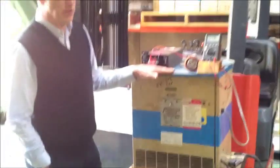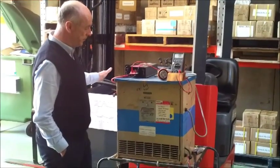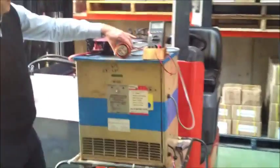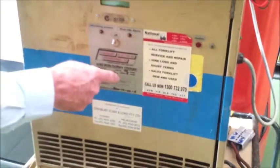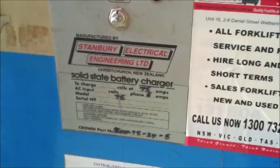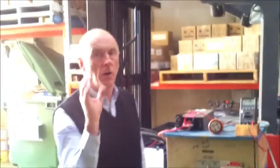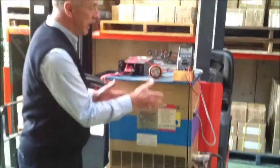This battery is normally charged with a charger of this size, and because of the power requirements of this battery, you normally have to have a three phase supply. This is the three phase plug from this charger. It normally charges at around about 75 amps and it takes quite a lot of power. A lot of people don't have three phase power or three phase outlets, so they can't use a charger of this sort which is normally designed for the big battery.